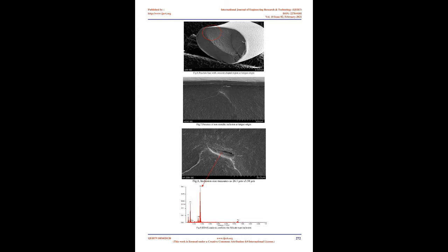Experimental procedures. Visual and macroscopic observations. As shown in Figure 1-2, the exhaust valve spring has failed at multiple locations, specifically at the 2.5th coil from both the ends of the spring. The fracture faces were cut from the failed portion of the spring as shown in Figure 3, cleaned and observed under optical microscope. The failure mode clearly indicates typical fatigue in nature, which has initiated from the surface in between the spring inner diameter and outer diameter and further propagated towards the core, Figure 4-5.